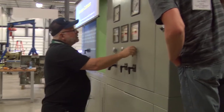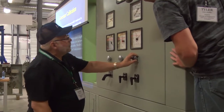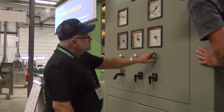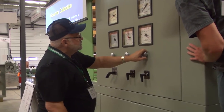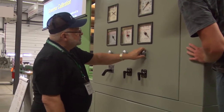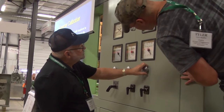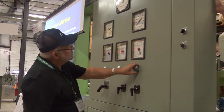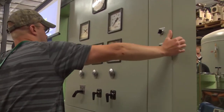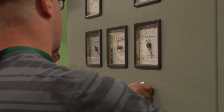They tell you on your span and your meters, if you overshoot or undershoot, like if you were to undershoot, you would do that a little snug and then take that set screw and move a little bit. Then you cycle your gates, because if you've made a change, they always want you to cycle your gates at least a couple times, so everything's reseated and going to sit where it's going to stay. Still over. Your gain is too much on that one, so we're going to go back on the cable.